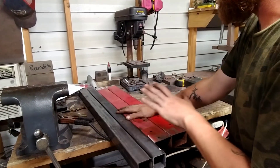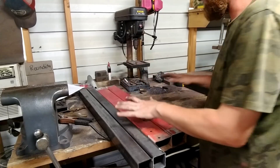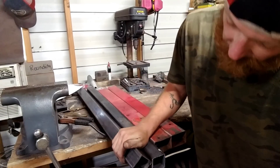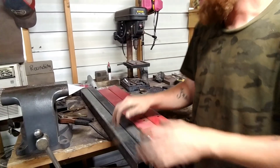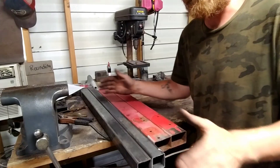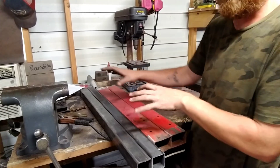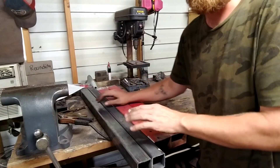I'm going to go through a list of what we're going to use for material. This is just for the frame that the press will be sitting on. I have 2x2 square tubing, 3/16 wall — plenty thick enough. I have two pieces of that cut at three foot. I want this thing to come out to a 3x3 square, that way I have a place for decking around the press. I can put sheet metal so I can lay tooling and also leave room behind it to mount the motor and pump and tank and all that for the hydraulic fluid.